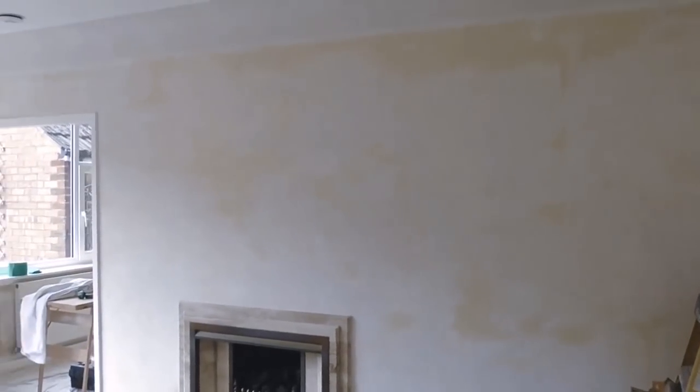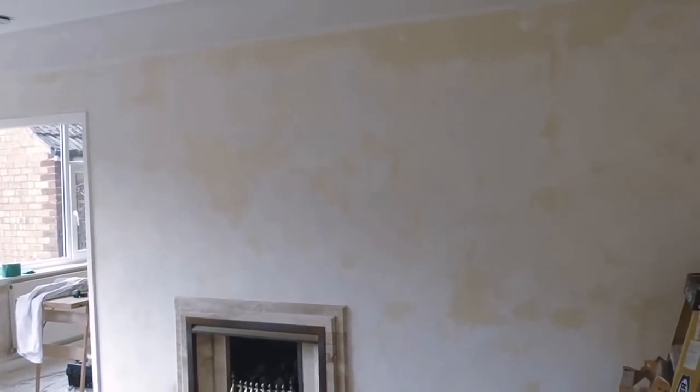Not easy at all with the 1400. It's a longer soaking time and uses twice as much paste, but when the surface is rough, it's what's needed. Look at the difference lining paper makes when you look at the walls over there. It covers over a multitude of sins.